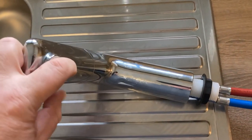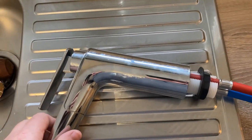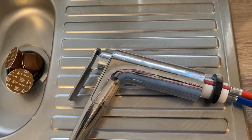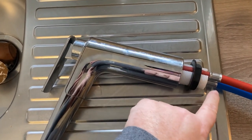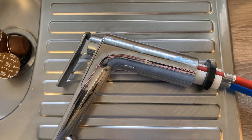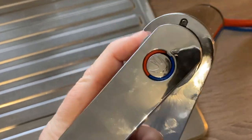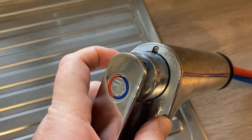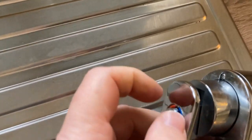Back at home now with the old broken tap. I can see the split under there. I'm going to strip it down and see how usable it is. This is the Reich Vector S - R-E-I-C-H, German I presume. The Vector S without the micro switch - you'll see on some of them there are a couple of cables for the micro switch. This works on a pressure-operated system only. First I'm going to prise out the Swift badge on top and take out this Torx head screw.